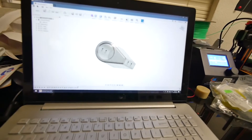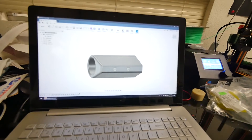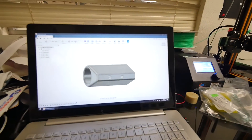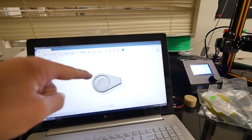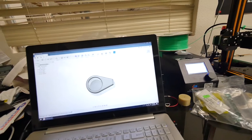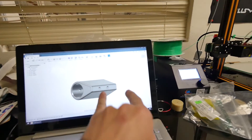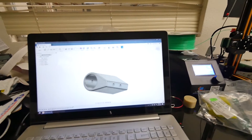Here's a piece of 42mm tubing and you can see it slides in. This is the 25mm tubing I'm going to use for the camera boom, and that slides in there — a nice snug fit. This will get two holes drilled for pins to hold that in place. Next up I need a drill guide so I can drill those holes through the tube in the right spot. This drill guide is large enough to put the nose boom mount and the 25mm tube in there, with some bushings, and I can hopefully drill the two holes right where they need to go. I should be able to print this pretty quickly.